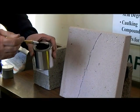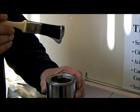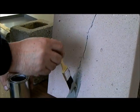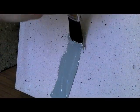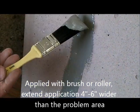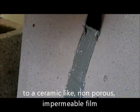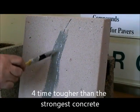It's very thick and it doesn't sag. We're going to apply a nice big layer of it over that crack so that we bridge it. We're going to overlap on both sides of the crack and fill those little holes. We usually start at the bottom and work your way up, making sure that you work the material in.